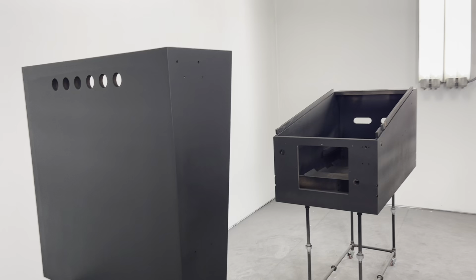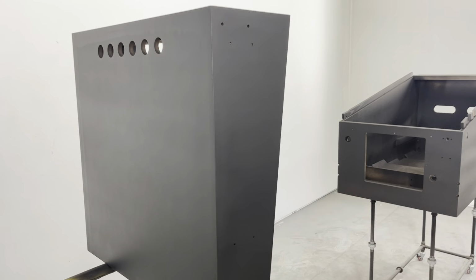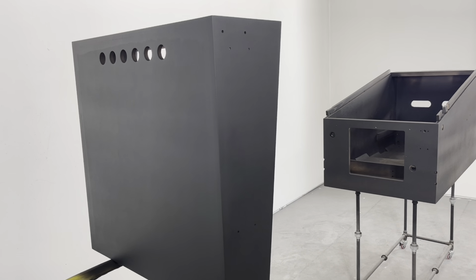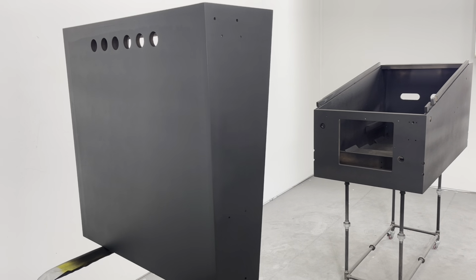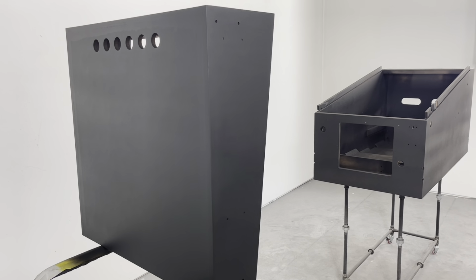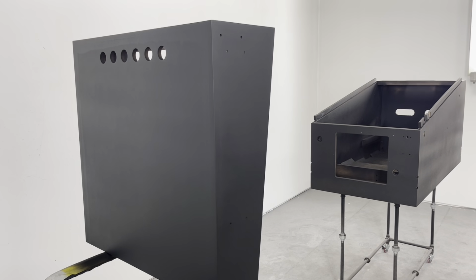Sealed and primed. Basically what I did was I sealed the cabinet and then I sprayed a single coat of primer on the back of the head, because that MDF has a tendency to get this little fuzziness to it. I'll try to show you, but you can probably pick it up. What that is, is the MDF wicking in the materials. As a result, I'll need to sand the back of the head. So I'll let it set for probably an hour or so, then I'll sand the back of the head and spray the cabinet and we should be good to go.